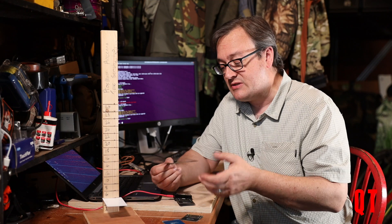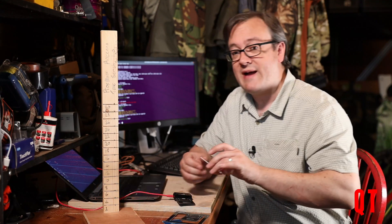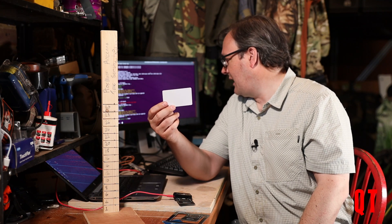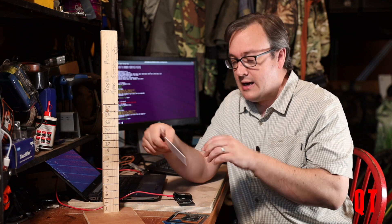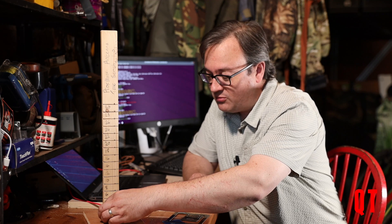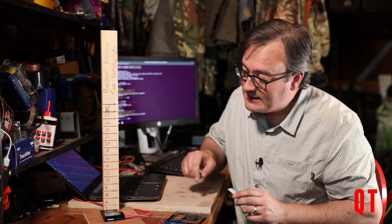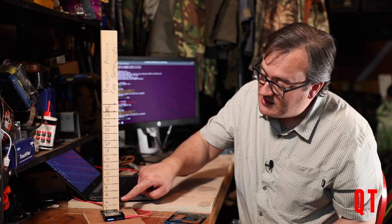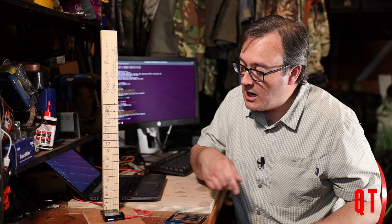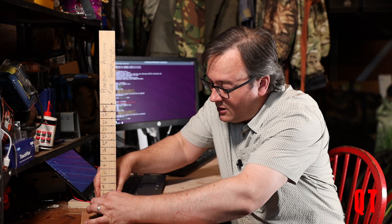What we're going to do today is some testing using my patented test kit. All it is: we have a card here — a bog-standard MiFare Classic, just a blank 1K — it just needs to be a test card, something to read. We have our Proxmark placed flat at the bottom. The rig is graduated from 2cm, 4, 6, 8, up to 30. If we get past 30, I'll use something else. We're going to place the card into the slots cut in there and see if we can actually read it.